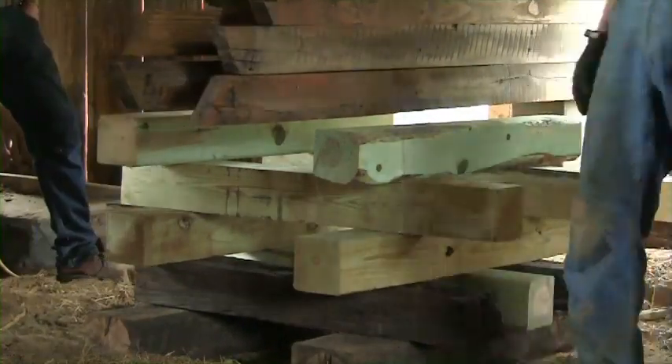Then you're ready to lift. You've got your 2x5s in, all screwed together, screwed to the post, nice and stiff, with your cribbing tower bases nice and level. The idea with this barn was to lift it up and pull it in, so that the homeowner can come in and dig out his foundation and pour new piers under the posts — getting them anchored down so the barn doesn't fall off the foundation for another 150 years.